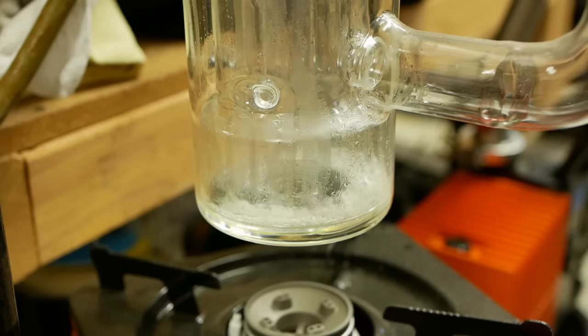While this thing is warming up, I have a funny story about this pump. I actually bought it a year ago for my mass spectrometry video and had a super difficult time getting it working. I had it hooked up to the chamber with a vacuum gauge and no matter how much heat I put into this pump, I couldn't get the vacuum gauge to read low enough — it wasn't pumping. It turns out it was totally operator error. I had a plastic tube connecting the diffusion pump to my mass spectrometry chamber, and in these high vacuum systems it was outgassing fast enough and the restriction was high enough that even though the pump was working, it couldn't actually lower the pressure in the chamber to decent levels — a combination of restriction and outgassing.